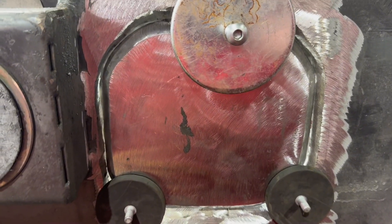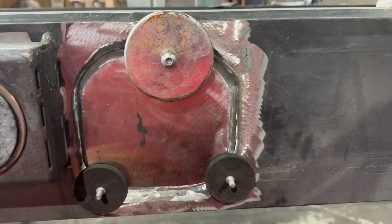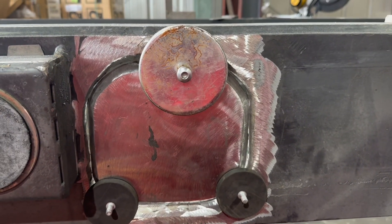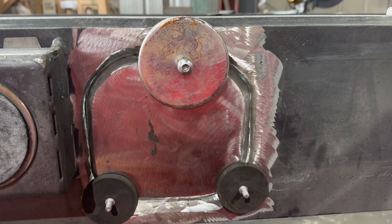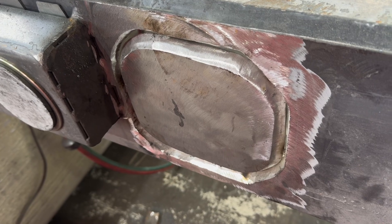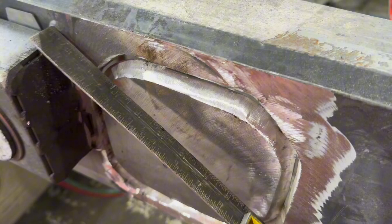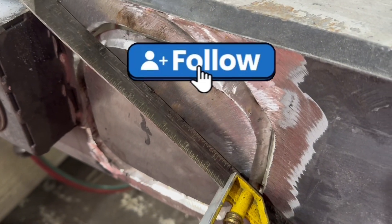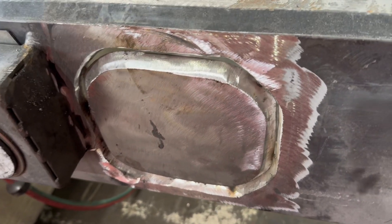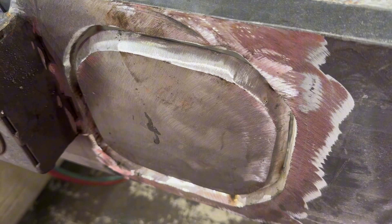I'll tack it now in all four corners, then get the slitting disc and pull it out. What we're going to do is use the stick welder and get some large welding rods in there — a bit of preheat first — then get a nice root run in there. The plate's tucked in with about two to three mil gaps all the way around. I'm happy with that. I've decided to shove the MIG in to give it a root, and then we're going to back-grind it, then stick it right.